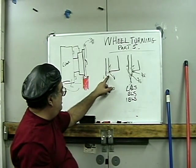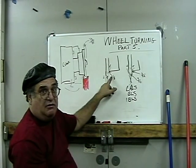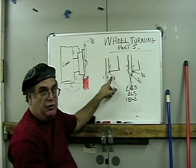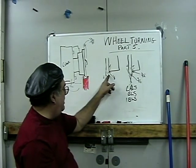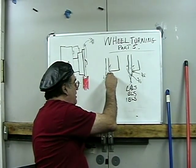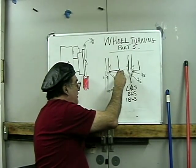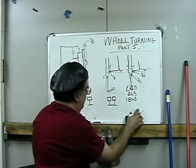What I do is make it 10 degrees on the radius side, put a one-eighth inch radius here — not three-thirty-seconds, that's too sharp a radius — and then straight on the back with just a radius there, and of course 3 degrees out this way, 2 degrees 50 minutes — well, you can call it 3 degrees — so 3 degrees here and 3 degrees there.